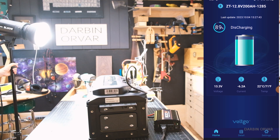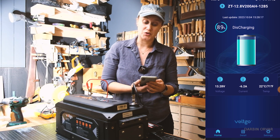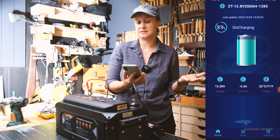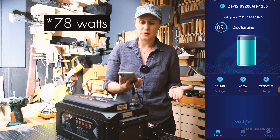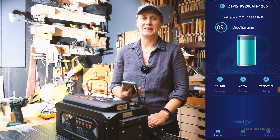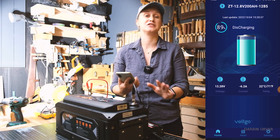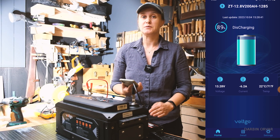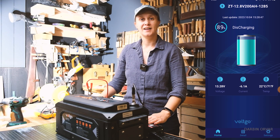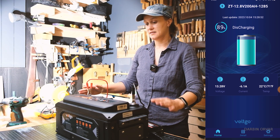That's a rather bright light. Now on the app we can see we're drawing 6.1 amps — 6 times 13 is about 70 watts that we're drawing right now. How much we draw depends on the inverter; if you have too small an inverter it could shut down. We wouldn't want to draw more than 200 amps since that's what the battery is rated at. So we have our little system here with our inverter, battery, and connection points.